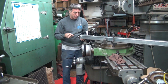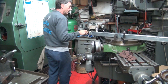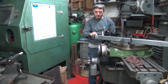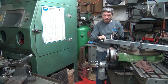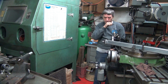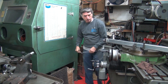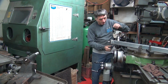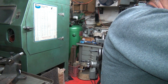1.652. Okay. So then we'll go up from that number. Okay, and that will be 100 thou deep. Then we got another 100, and it's probably another 150 more of that. At least 150 more depth past that. So put another 150 more depth past that. And that one we're going to have to go up to the big size radius shoulder. That's going to be up over in 1935. It's just probably bigger than the thing is here, right? Yeah. I think it'll be bigger than that.